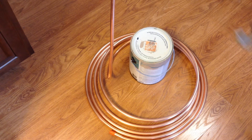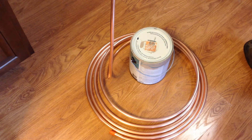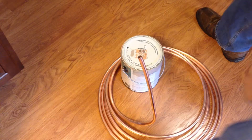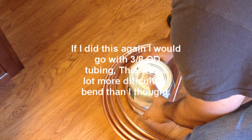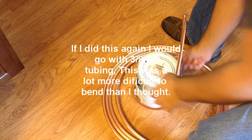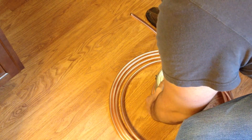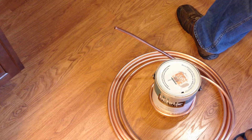So I'm going to cut some of this pipe. I have a small pipe cutter here. I'm going to clamp and spin around, because I have some elbows that I'm going to use instead of just trying to bend this pipe. Take your time with this because you're really only going to get one shot to bend it around — you don't want to be bending and coming back like that.